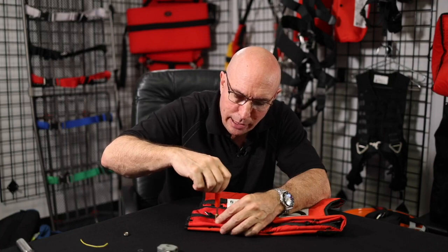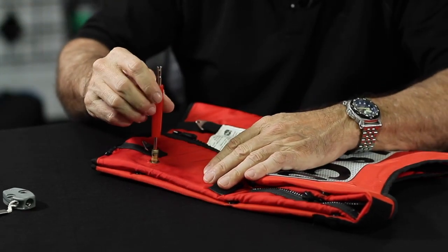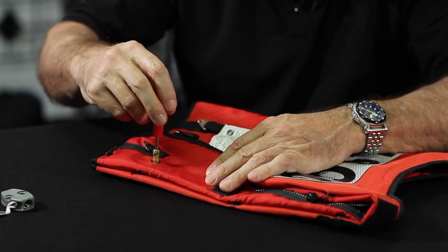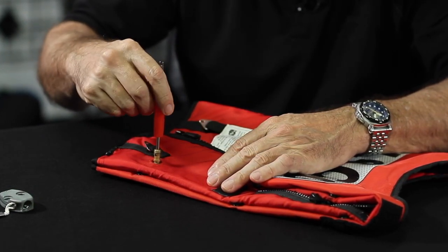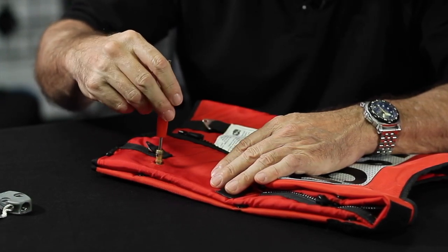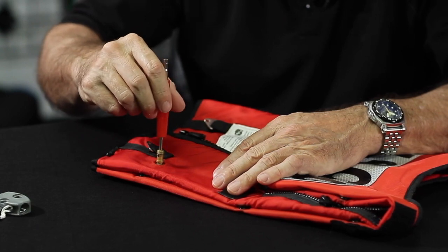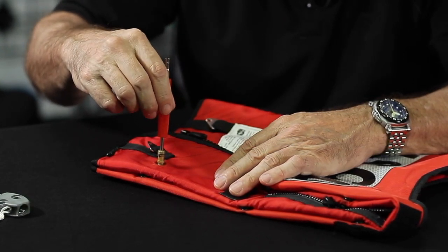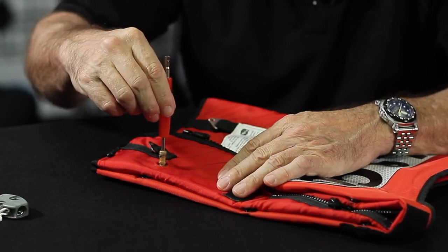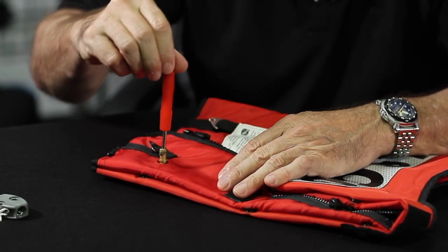They just screw down, and the manufacturer says 1 inch-pound, which is almost impossible to measure on any device. So you just go till it's fully seated. You can feel that gasket fully seat. Once you get down to the bottom and it's a little back pressure, quarter turn. That's all you got. That's a good set, and that thing won't leak.